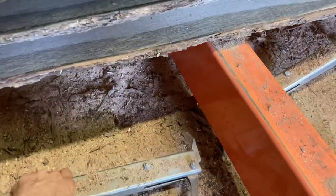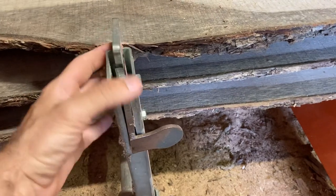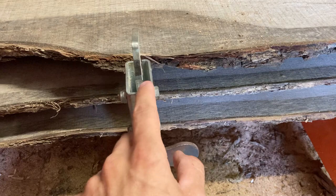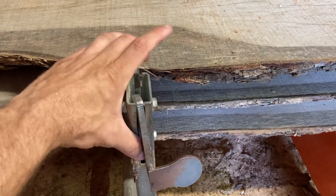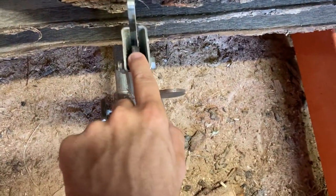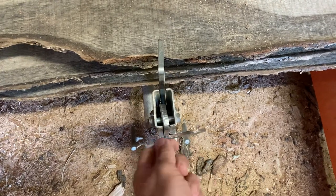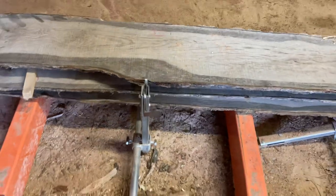Next, let's talk about the log clamps. I would really hope that they've changed this design by now, because it's an engineering and design flaw. Over time when you try to clamp down your log, these lobes will slip past each other — they will slide past each other and it's very frustrating. You can see how worn out that lobe is already. They really either need spacers there or maybe a twist-style clamp. It kind of needs a redesign. I do not like that.